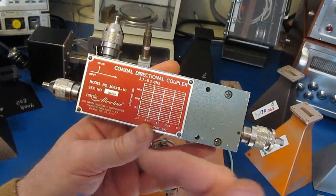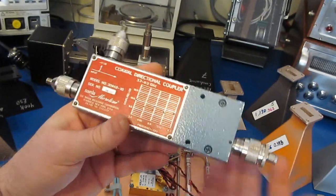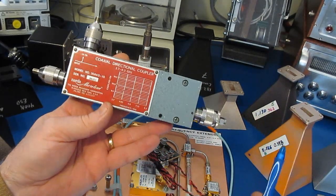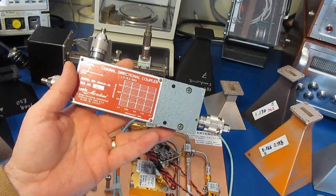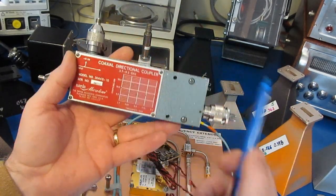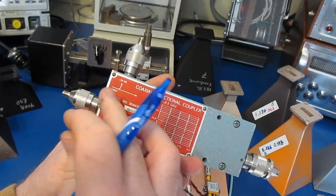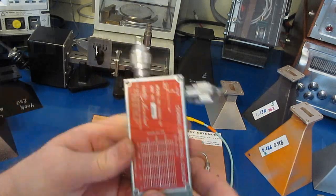I had mentioned that in a video a long time ago. Somebody was talking about trying to measure antennas. It was a ham operator, and I guess they had some radio station that was local that was screwing up their measurements. And I talked about putting an amplifier on the output of the VNA to basically increase the signal to noise ratio. So you would drive that into an external coupler and then feed that back. And I set up a little experiment with that. I didn't go so far as to make the measurement because the software at that time didn't have the ability to flip the port, but I've gone ahead and added that feature for these experiments.